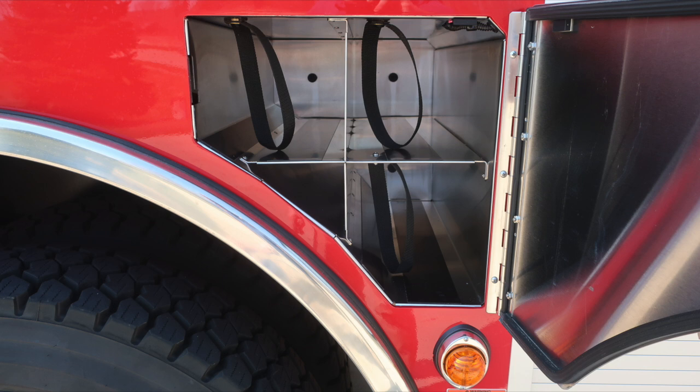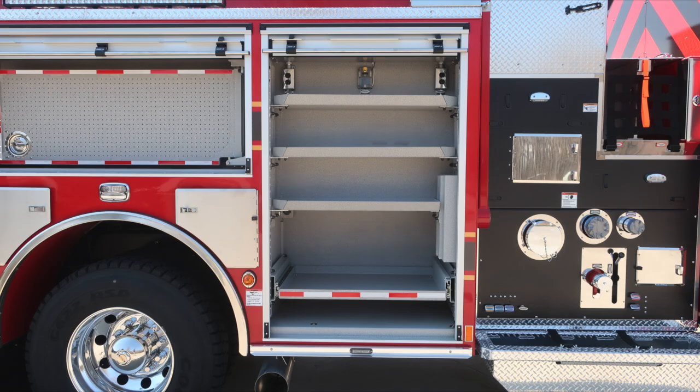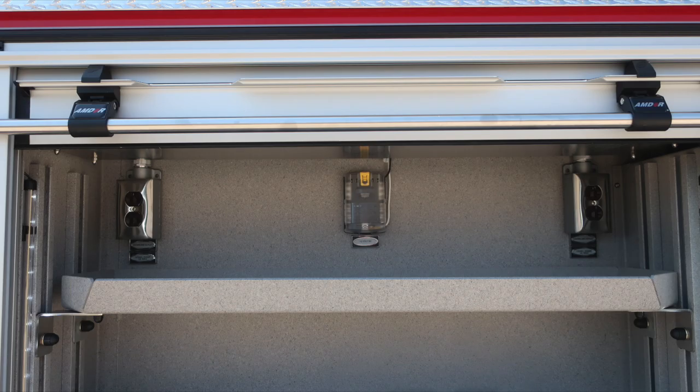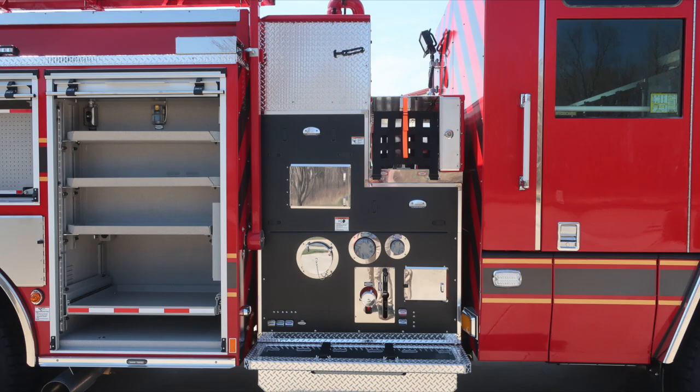This is also the location for your diesel exhaust. Extremely hot diesel exhaust temperatures do exist, especially during regen operation. Be cautious where you park your vehicle. As we move to the forward section, in the upper portion of this compartment, we have 12-volt access via bus bar, and then also 2 outlets forward and rear that are 120-volt, which will be plugged into Shoreline Power. Those will be active. Down the lower compartment, release located on the lower right.